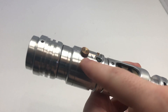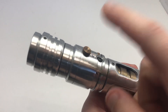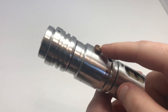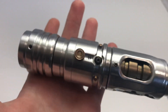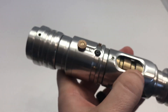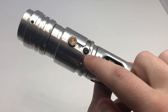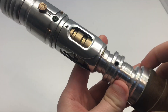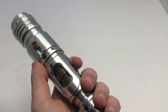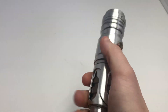I replaced the top screw. There was another screw here which didn't align with the hole on the inside, so I just drilled it out completely. This is not a thumb screw — it is glued in. However, I did knurl it and did some aesthetic design to make it look nice, trying to match it as best I could with the rest of the brass on the saber. This screw is solely holding on the top piece right here, and it secures it very well. Power is on this side and auxiliary is on this side, which gives it a better platform for holding.